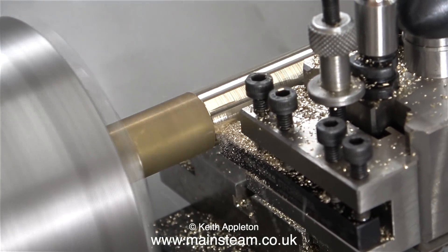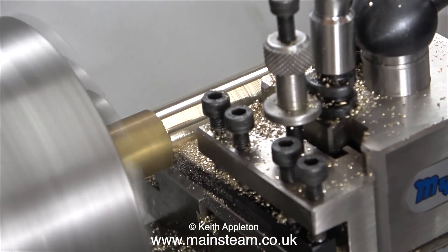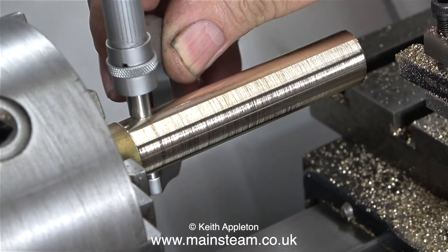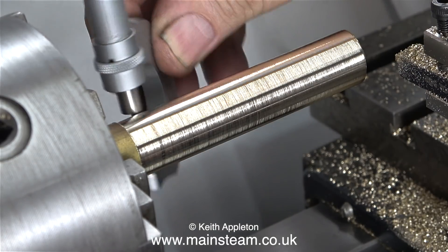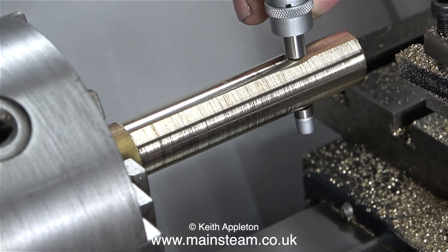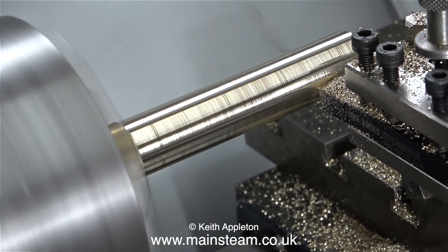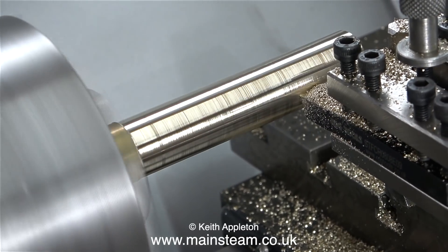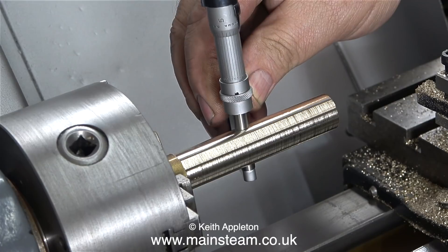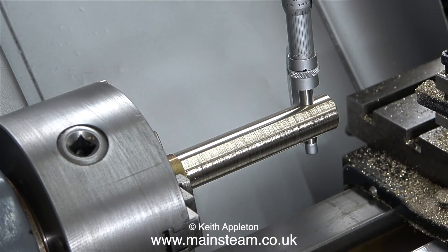The end float is adjusted by two rings which support the rear bearings. The big question is: does the lathe cut parallel? Measuring with a micrometer near the chuck, in the middle, and at the end of the bar, the feel is slightly slacker at the far end but I'm quite pleased with the initial result given the problems that need sorting out. After taking a very fine cut — the video runs at double speed so you don't slip into a coma — measuring again shows the diameter feels the same throughout, so the bar is parallel. This is quite encouraging.